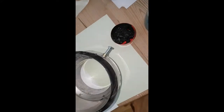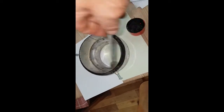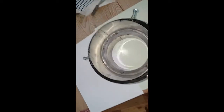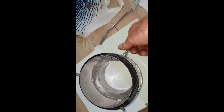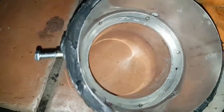Next stage: I've got the adapter from the five-inch to the six-inch flue pipe. The flue pipe is going to sit in there. I've got some fire cement, so I'm going to spatula that out and squeeze it all in there. This has a push-up on the pipe and then I need to do that up with a 10mm spanner. I've put all the heat cement all around there — that needs to go up.